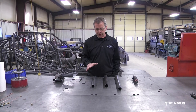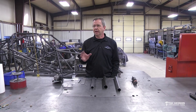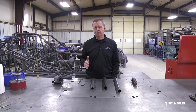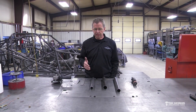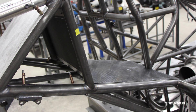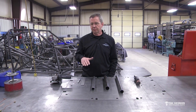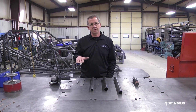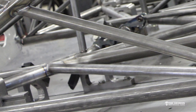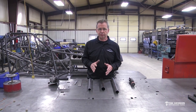We're going to go over some fits, and on these chassis there are tons of different angles, different joints, all kinds of degrees of fits. Very few of them are straight and square — most have a little angle to them. Some might be fit in a corner, some might be intersecting other tubes, some might be smaller diameter intersecting a larger diameter tube. And those might also be off-center — if they're in the floor area, the smaller tube might be moved up to the top side of the bigger tube so the top plane is level for the floor.